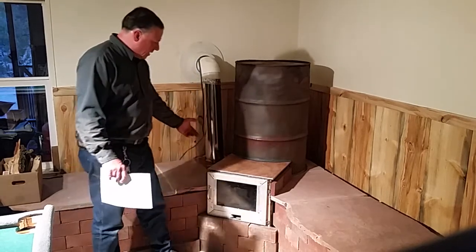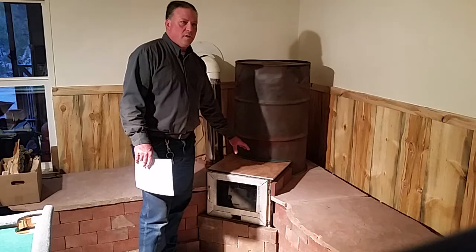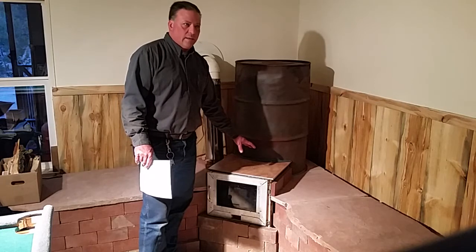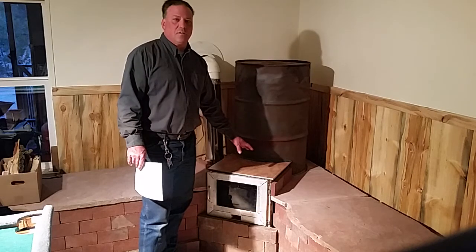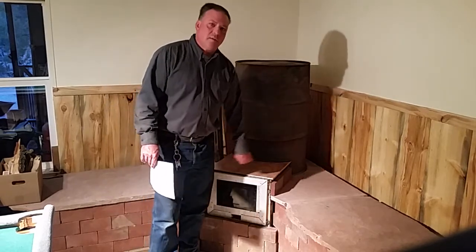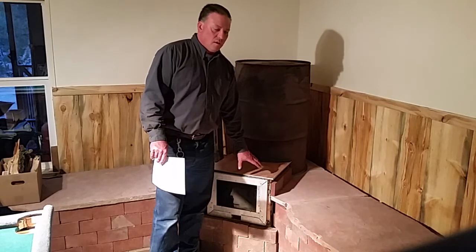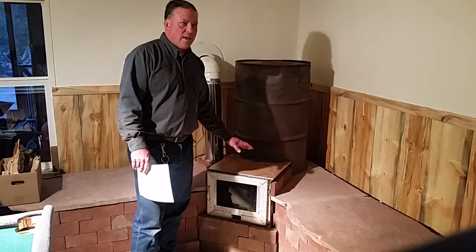On the outside of that I have some red brick on top. Yesterday I had a tile on here for my first burn. I was thinking these things are fired under 2,350 degrees so they're not going to crack, because the box probably won't get over 700 or 800 degrees. But guess what — it cracked. So I replaced the tile and this time I put ceramic fiber blanket underneath the tile, and underneath that I put a piece of stainless steel metal spanning over the top to provide a heat shield as well as some support.